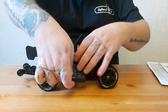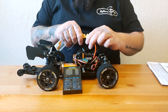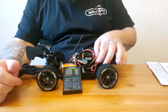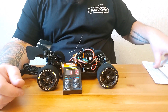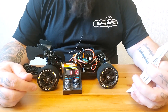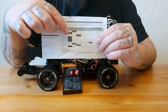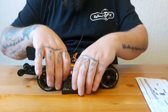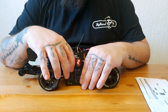Once that's in, it's ready to program. Plug in the battery, then turn the ESC on — the programming card comes on and you'll notice item and value displayed. Item one, value two — you can change the value by pressing the value button. It only gives the number of options specified in the instructions.